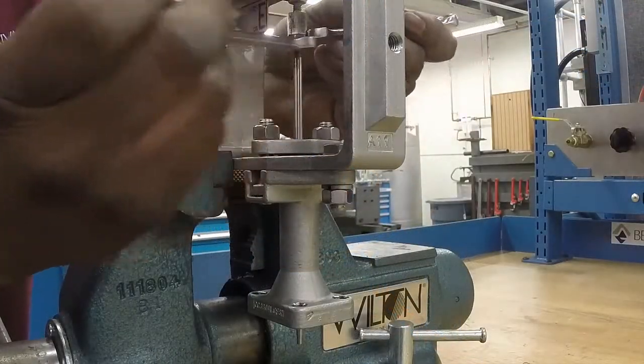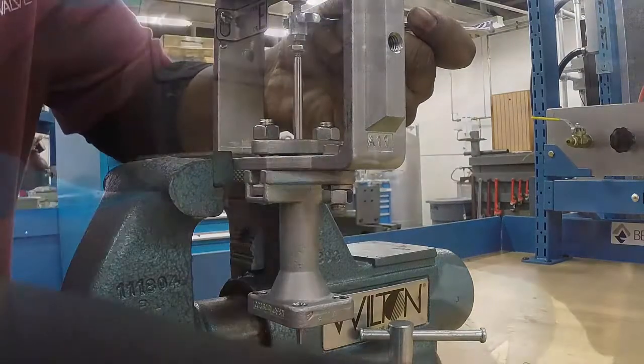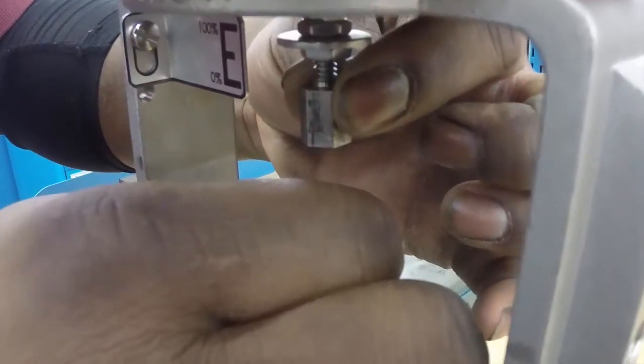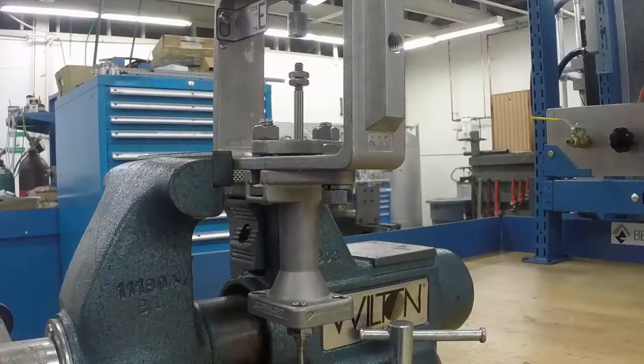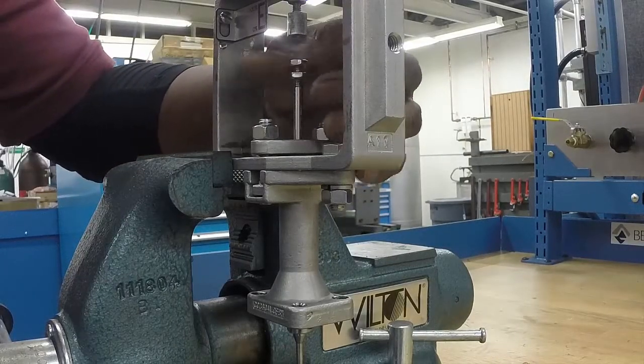Next, loosen the body side lock nuts on the stem using 3/8 inch wrenches. By locking the nuts together again further down the stem, you can use them to unthread the stem from the stem connector. Make sure that the stem connector does not rotate to eliminate any change in actuator preload pressure. Now you can remove the lock nuts from the stem.